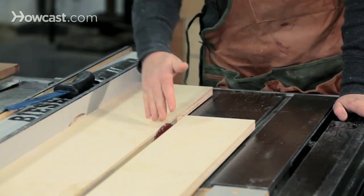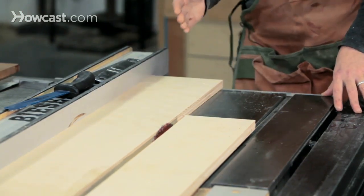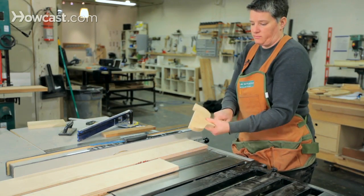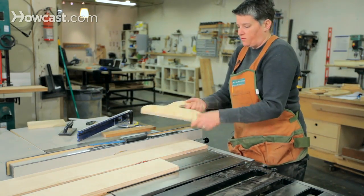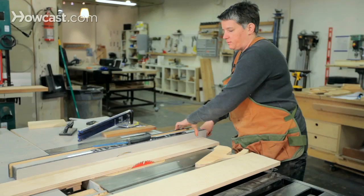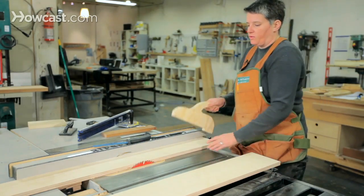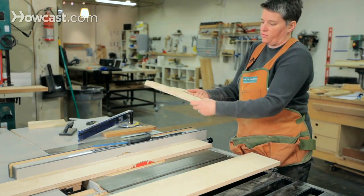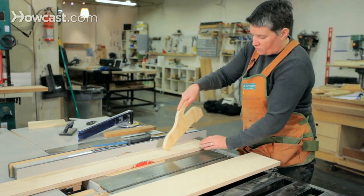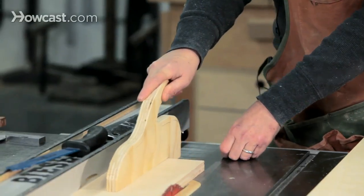When you're at six inches and greater, using your hands is a reliable and safe way to push wood through the table saw. If it gets smaller than that, you're going to want to use a push stick. This is a homemade push stick — you can buy these pre-made, but it's easier just to make them. For a narrower cut, anytime you get narrower than six inches, use a push stick. It has a notch cut out in the bottom to grab the back of the board, a nice long front to hold down, and a handle that puts your hand way above where the cutting is happening.